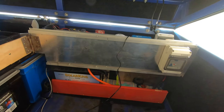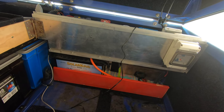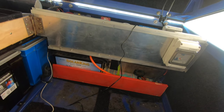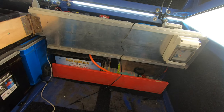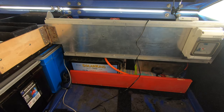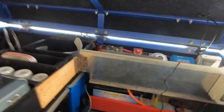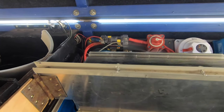One fuse for each battery. Those batteries are 100Ah, 12 volt, with a 100 amp maximum continuous draw. I've got 80 amp fast blow fuses in there - there's no way in the world I'm going to draw 200 amps. I worked it out: the max I'll be drawing is around 130 or 140. I've got a 150 amp fast blow fuse at the top. So the fuse block at the top is 150 amp and the two at the bottom are 80 amp.